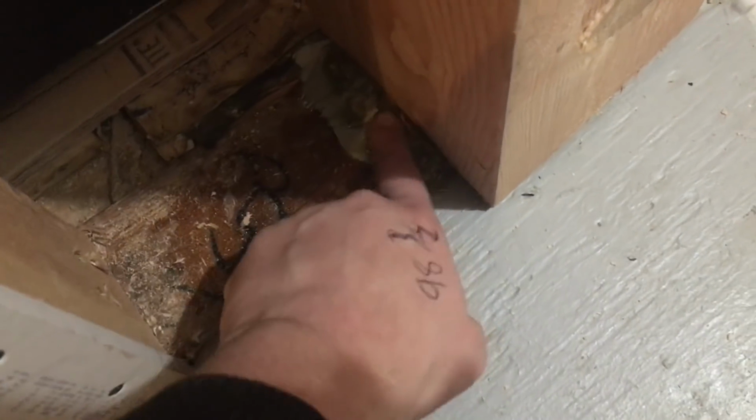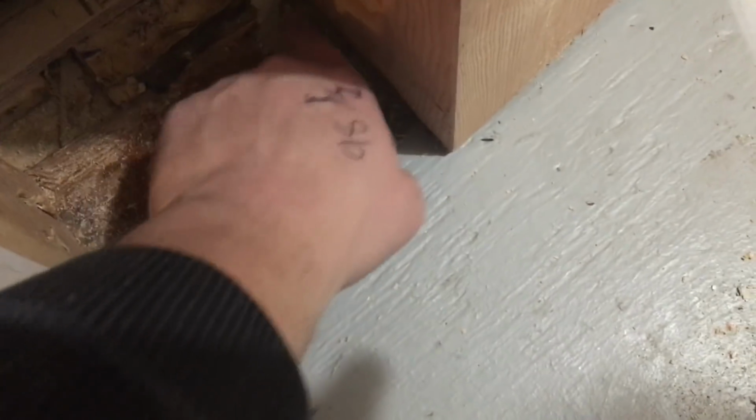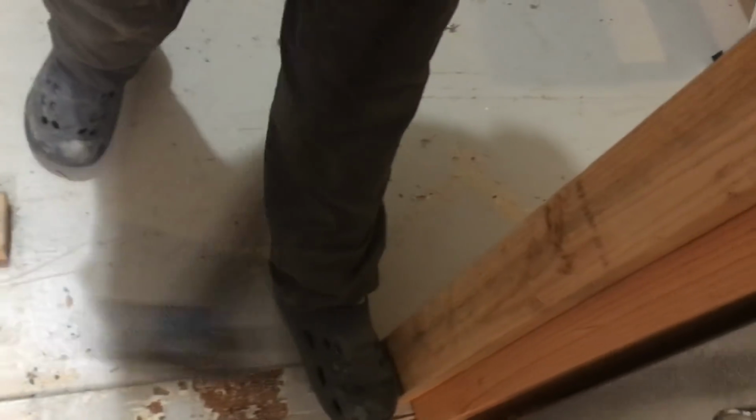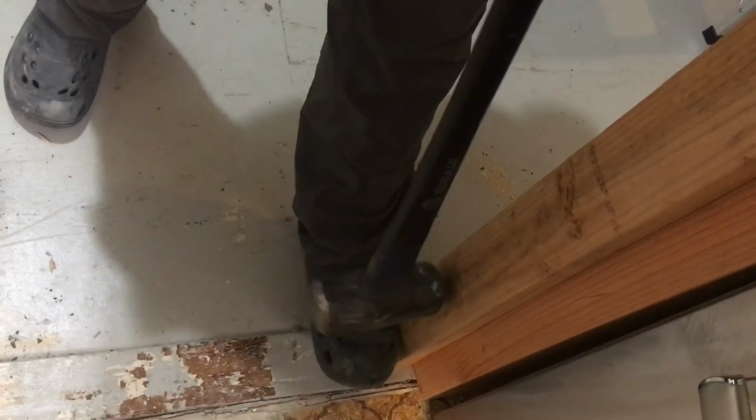All right, so we're pounding this beam in, and Didi came up with a good little trick for us. So we're trying it out. It's working real well. We're putting dish soap down below to help lubricate the beam as it slides in. It should be working pretty good. Yeah, it's working really well. Moving. Whack-a-mole, yep. It's getting close. Good. Almost there. Yep.